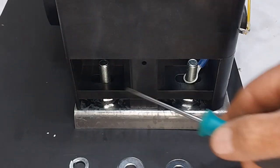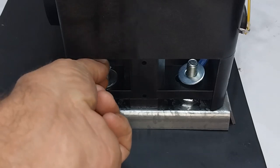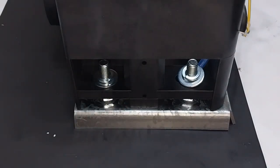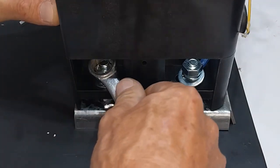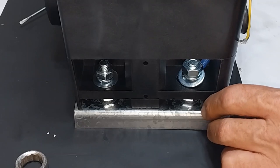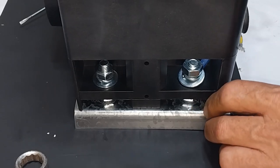An earth wire is placed on either of the steel bolts. Then steel washers are placed onto the steel bolts, followed by spring washers and then the steel nuts. The steel nuts are secured down completely with a 17 mm spanner. If the gate motor is not 100% aligned with the steel sliding gate, one can still adjust the gate motor to be parallel. One can also still move the gate motor forward and backwards so as not to cause an obstruction onto the steel sliding gate.